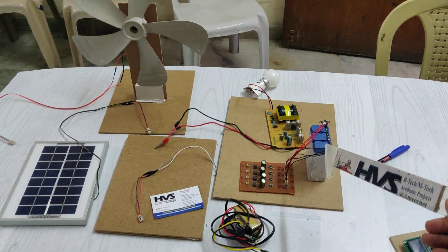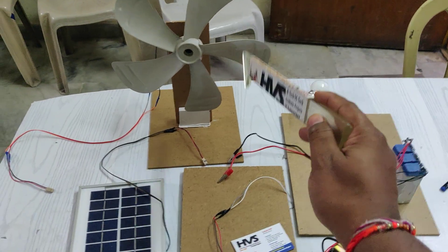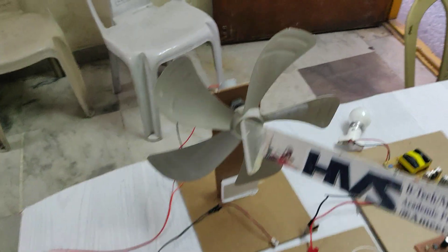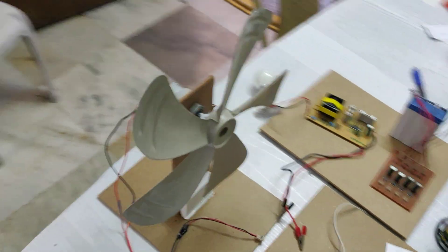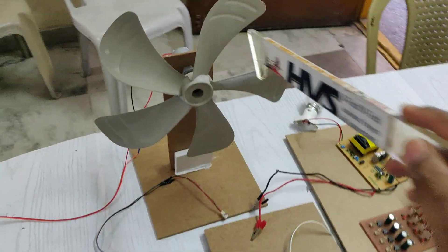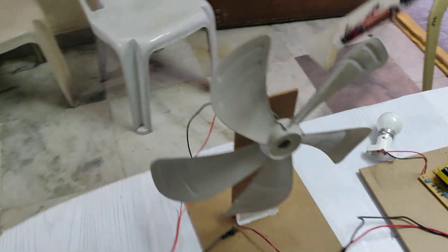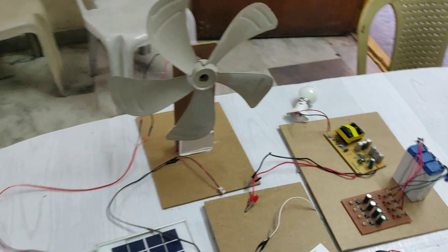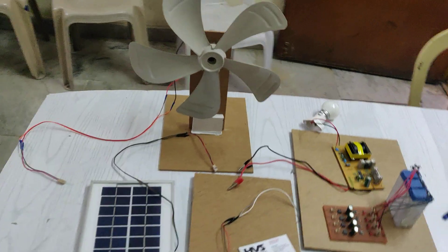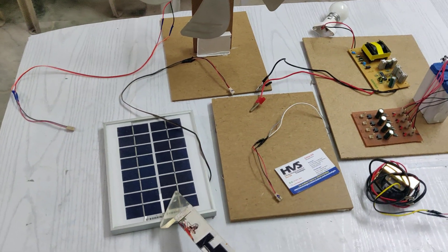For the source ratings, we are using a 12V 20W DC generator. This DC generator is attached along with a gearbox with a gear ratio of 1:2 — so whenever the wind turbine makes one rotation, the gearbox converts that to two rotations as input to the 12V 20W generator.